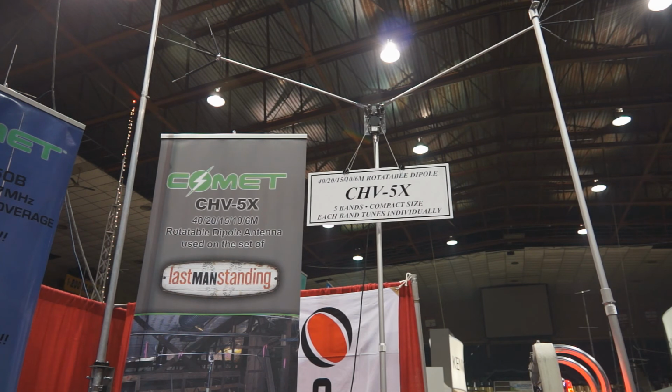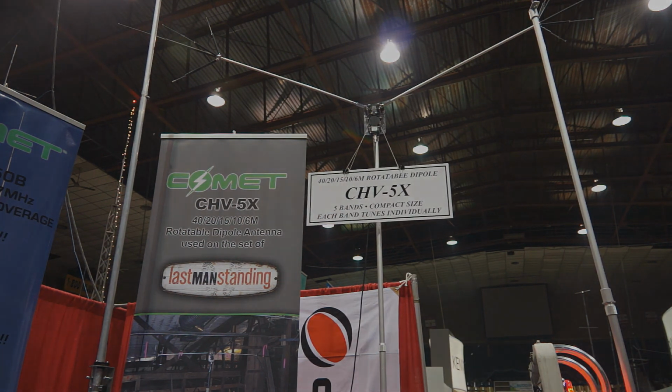5 bands, we've got 40, 20, 15, 10, and 6 meters. Each antenna element for each band is tuned individually, so you can tune this tuning stub, slide it in and out to set it to the exact frequency you're going to transmit on. Small, compact, 5 bands, about a $325 antenna, designed specifically for economy and small, tight areas.